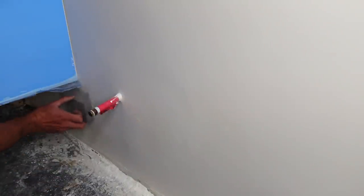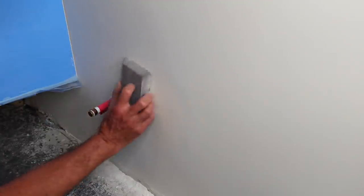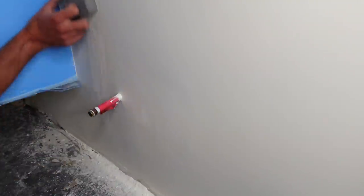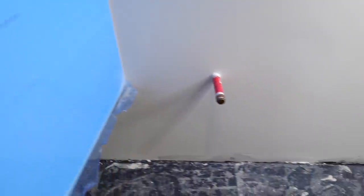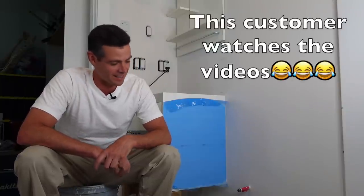You can put little pieces of drywall in backwards — upside down, whatever you want to call it. It's kinda dumb. I would definitely not ever recommend it if you don't actually have to do it for some reason. I just did this for the YouTube video. It works — looking pretty good, especially for my house. There it is, all sanded and cleaned up, and even sanded in here behind the cabinet, even though I probably could have gotten away without doing it. So yes, it can be done. It should not be done in almost any circumstances, especially if your customer can see it. But it could get you out of a pinch. Don't use any of the factory edges if you have to do it.